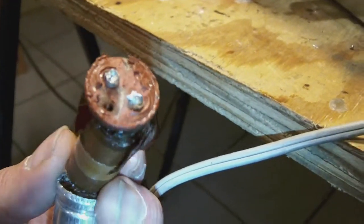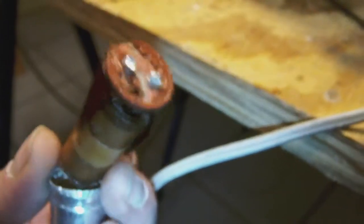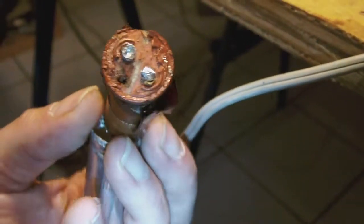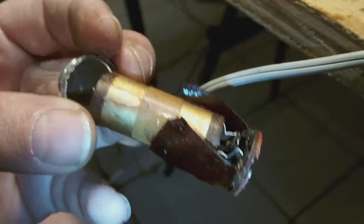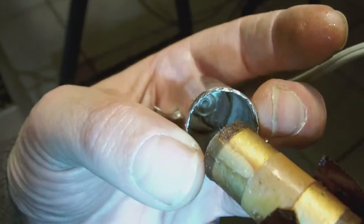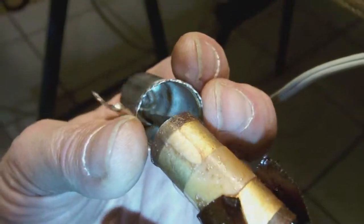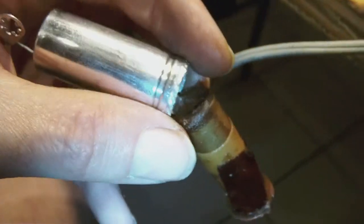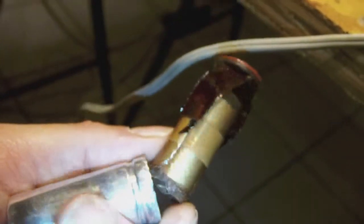Now what I did was I took away some of the rubber which was on top, or well, maybe it's a sort of putty, I don't know, and then I started to pry carefully open the edges that were crimped around the bottom plate, which is made out of a piece of cardboard covered with some brown colored putty. And then it just slid out, and as you can see inside there's just a long aluminum strip which connects it to the can. So the can is really the ground of the two capacitors, and the two electrolytics are inside these rolls of paper and aluminum foil.